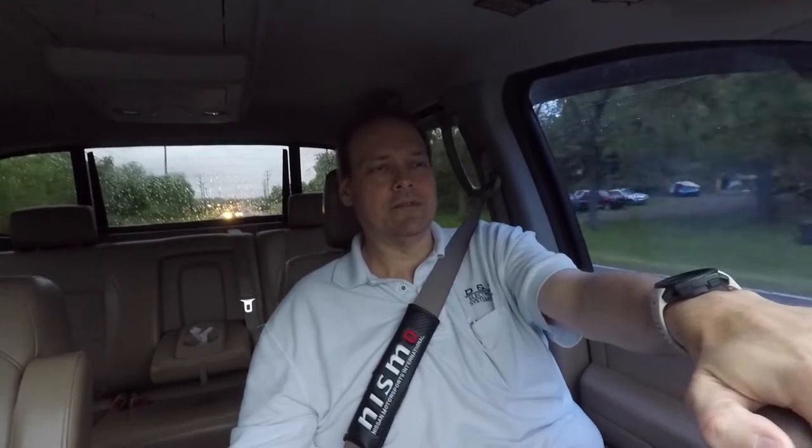The only reason I could think of that I'm losing audio was because of the GoPro box you have to use for audio. What was happening — I'll show you on the workbench in a little bit — is the cage I was using: when the cable comes out and plugs into the GoPro, it was too abrupt, too sharp of a turn. It was bending the cable, breaking the connections and the wires inside. That bend would be enough that after a while it would lose the connection and you'd lose your audio. I noticed it on a couple of videos shot with this setup.